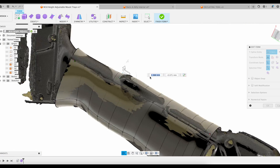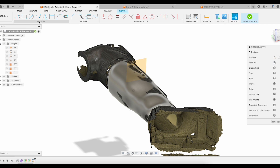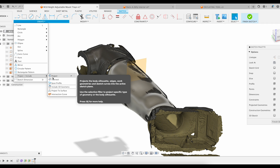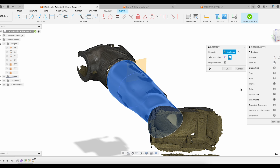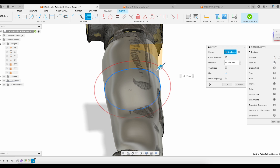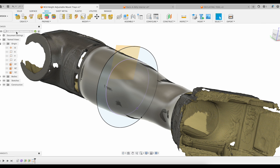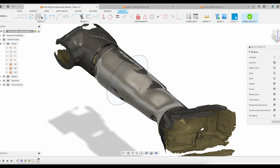As far as adjusting the surfaces - the forms - this is more of an art than a science. I just got it pretty close; you can see it just outside of the shape of the tool. After creating a plane roughly where I think the clamp needs to go, I did an intersection sketch to give me that profile. From there I just offset that profile by 14 millimeters to give me the thickness of the part that I wanted to create, which gives me a nice area to use for the actual solid.